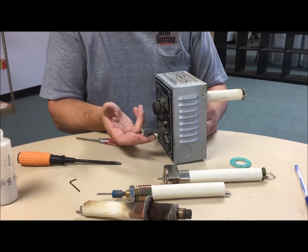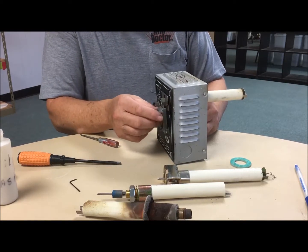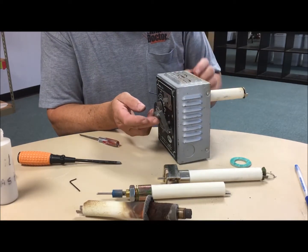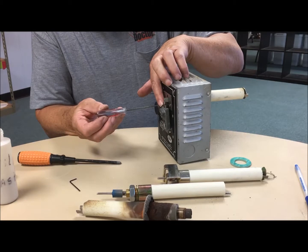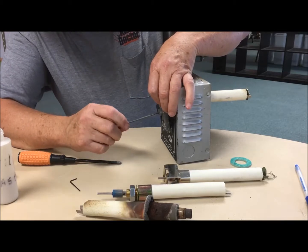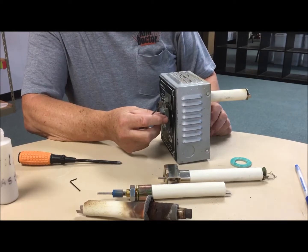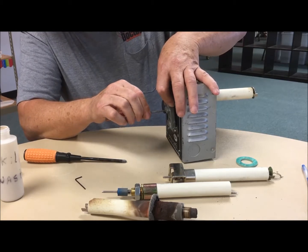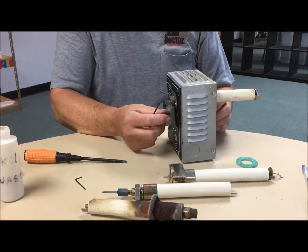The next thing we're going to do is check our trigger — this is the weight, and this is the actual trigger. With the guide key in place, you lift this up. This plate should just clear the tip of that claw. If this is too high, it's out of alignment, so you need to readjust with your new sensing rod and cone supports to get back to alignment. It should just miss.